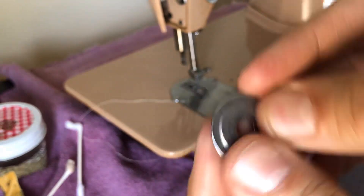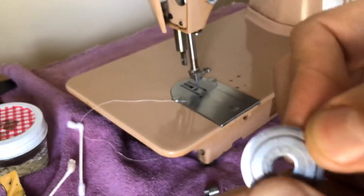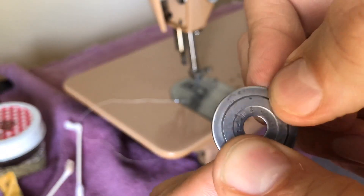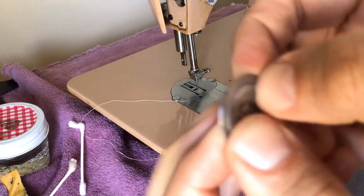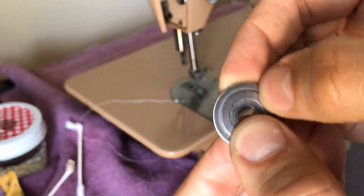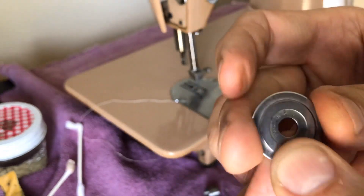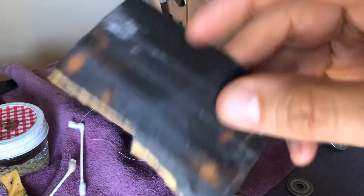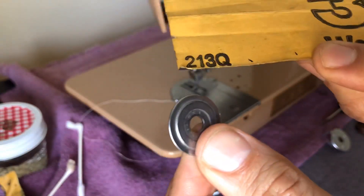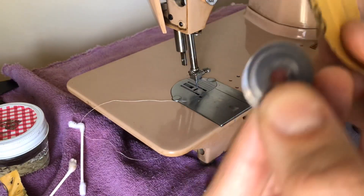Sometimes you're not sure what you've got — is it simply stained or is it pitted? There's a little place right here that's a different color. A lot of times you can take your thumbnail or fingernail and go across it, and if it's pitted you'll feel a bump. I did feel one, so I went and got my wet/dry sandpaper — 600 grit. I wouldn't use anything rougher than 600, though you can also use 800 or 1000 grit.